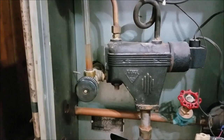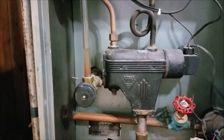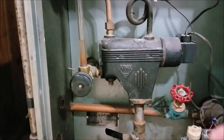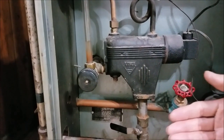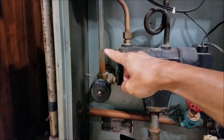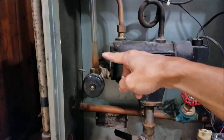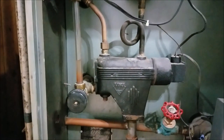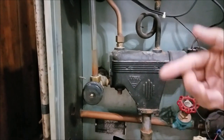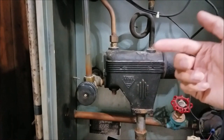So if you have a leaking system, or the vent valve leaks, steam goes out to the atmosphere, and you lose pressure, and the boiler works harder and harder, and it's going to cost you more gas, and that costs you money. That's why I'm showing you the water level right here. If the steam keeps boiling the water, the water level keeps going down. And then the system needs to add more water into the boiler. With new water coming in, more gas has to burn to heat up the water to form steam for the system.